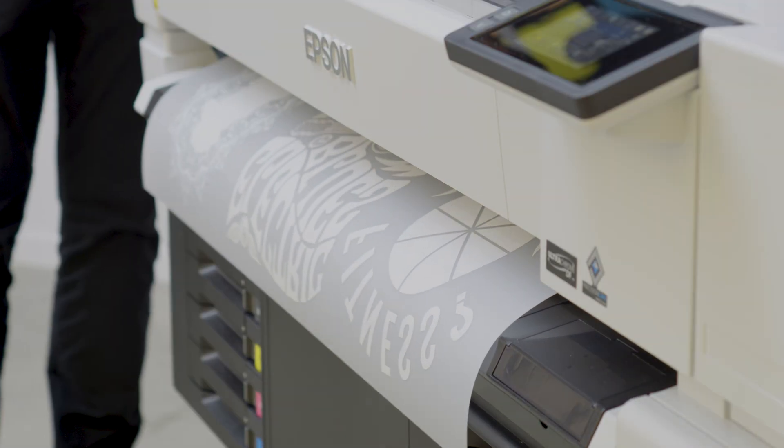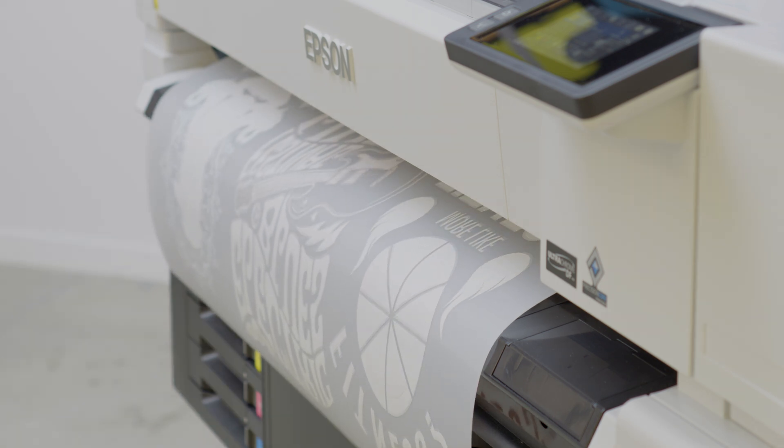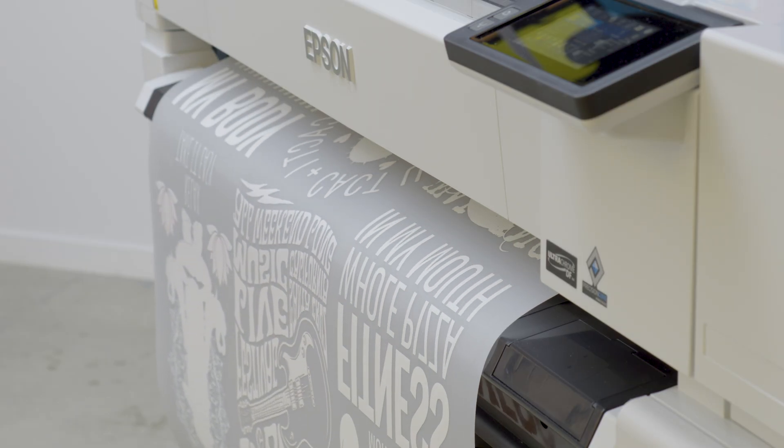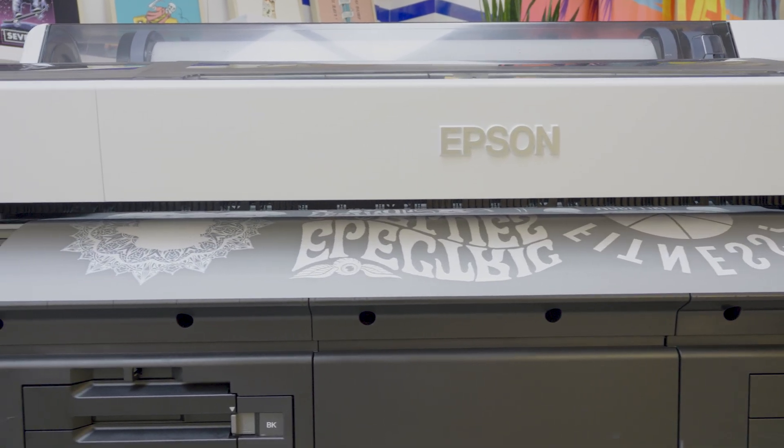What's fascinating about this machine is that it's a single-head printer, yet it's getting output comparable to printers that have two or more print heads. Can you talk about the technology that supports that? Because we build the print heads ourselves, we're able to control that print head however we like. We can use a single head to fire CMYK and white ink on a single pass, getting comparable output speeds to multi-head machines that have a head dedicated for white and a head dedicated for color. So it's really about the output of the machine, not the number of heads.